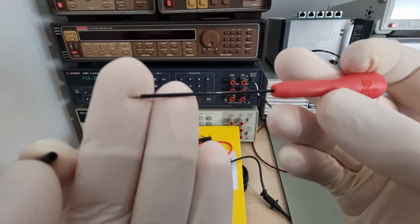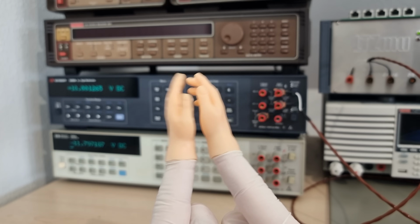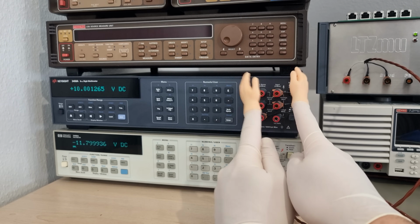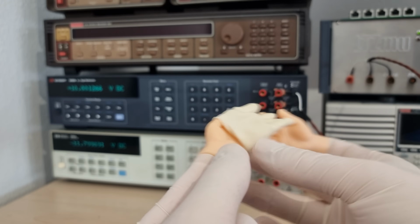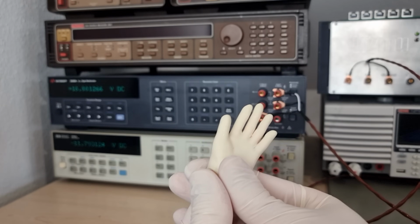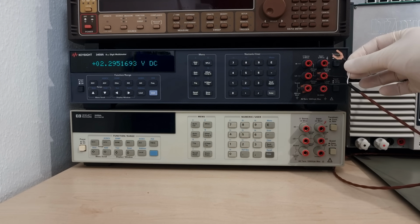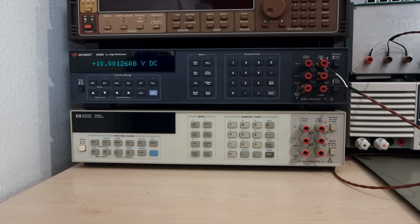Of course, no video would be complete without me mentioning my daily fix of pure copper spade connectors. Much better suited for ppm counting. They do, however, tarnish easily when touched with bare hands. The multimeter input jacks, on the other hand, are gold-plated tellurium copper, with similar low thermal EMF performance, but great immunity to oxidation. In my previous video about the grey HP meter, I focused mostly on the ingenious analog technology behind the scenes. Today I'd like to take a closer look at more practical details and applications instead, because the technical foundations are all the same in both meters.